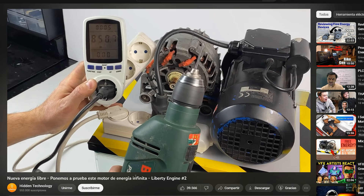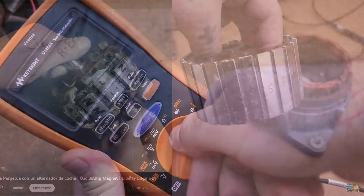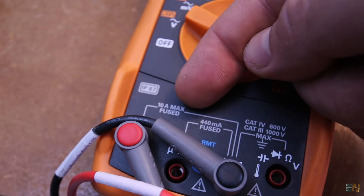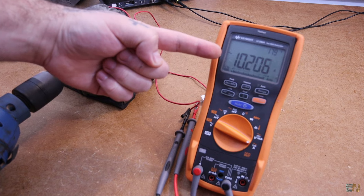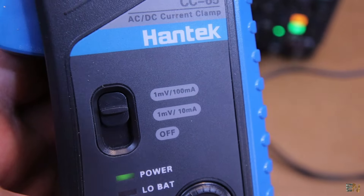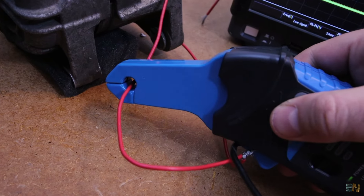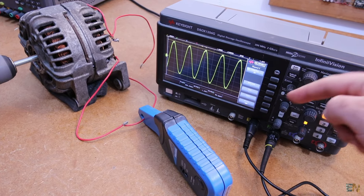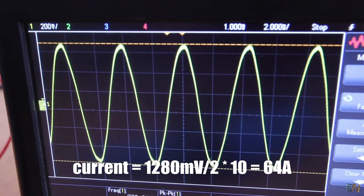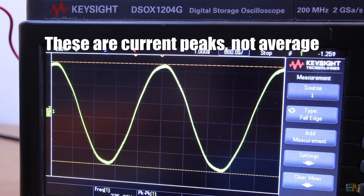Let's test it a little bit. First let's measure the voltage — I connect a multimeter at one phase of the output in AC voltage mode. I rotate the generator using a drill and measure the voltage without any load at the output, also trying to measure the speed for later calculations. The maximum voltage I got on my multimeter in AC mode is around 8V, so maybe 15V peak to peak on one phase. So I don't know how the people from the fake energy video are getting 220V AC, because I'm using better and bigger magnets and only get 15V peak to peak.